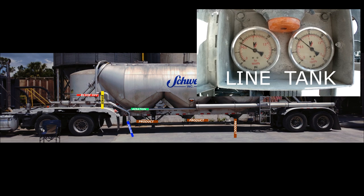Pumping at the same PSI, 10 to 12, would get better product aeration and better pushing power, as long as the same amount of air being pumped into the silo is being exhausted out of the silo at the same rate. Third, how high a PSI you are pumping at. If you can keep between 13 to 14, you could take off maybe another 10 to 15 minutes, but the chances of plugging up are much higher. Fourth, length of pipe pumping through. If it has any twists or bends, or a sideways pipe on the way up to the silo, this would add time to pumping.